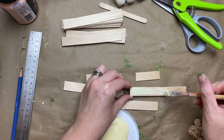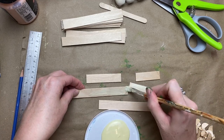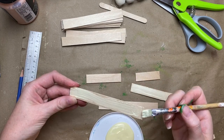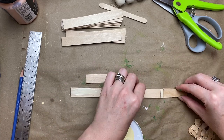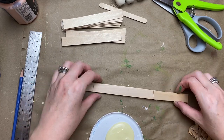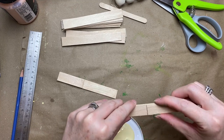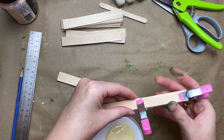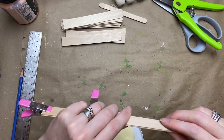I'm going to cut one of them in half, and I've also cut the rounded parts off so there are no more rounded ends. To give this strength I'm using wood glue and lining them up so the seams are alternating — not matching — just to give it strength. I'm using a bunch of clips to let them dry together so they don't warp or come apart.